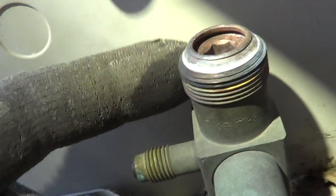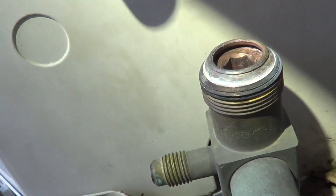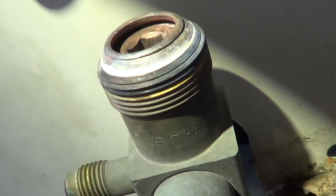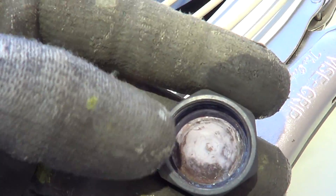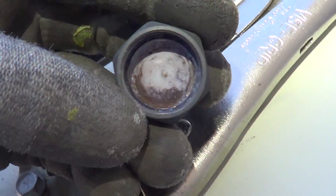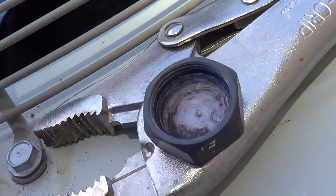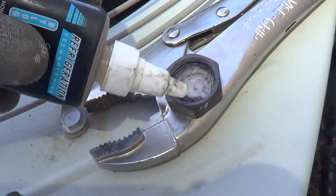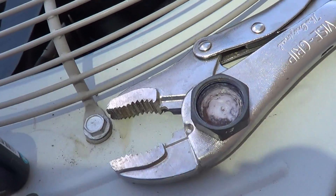This one didn't bubble. Sometimes you'll hear them crackle and bubble. But we're dehydrated because we boiled off the water. You can also tell when these caps look nasty like that — they're just sucking in moisture and also leaking. So use your nylog, put it on your cap, put the cap back together. You're good to go.